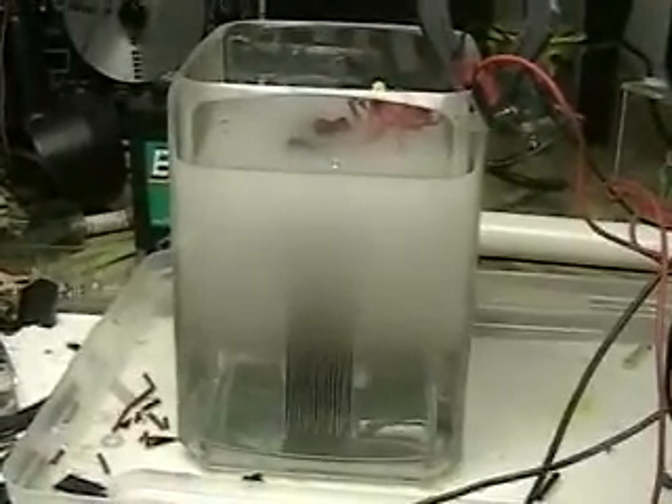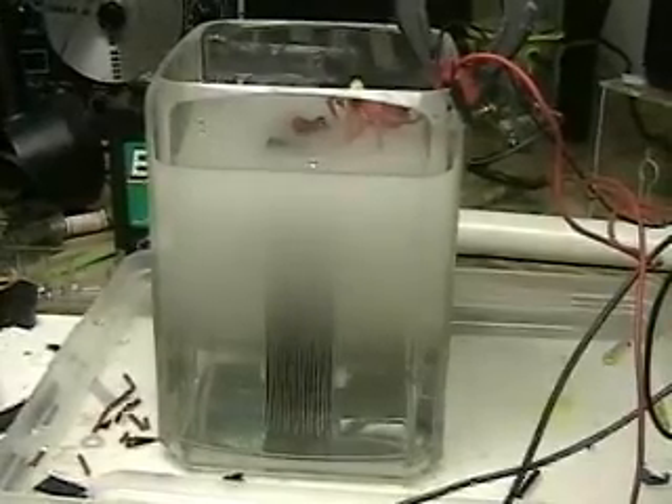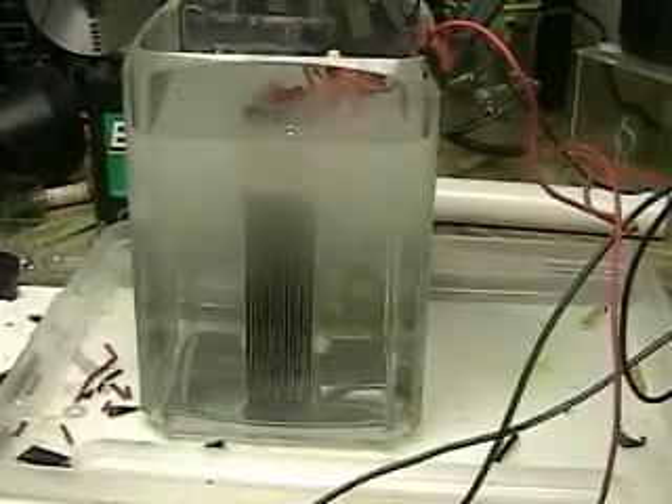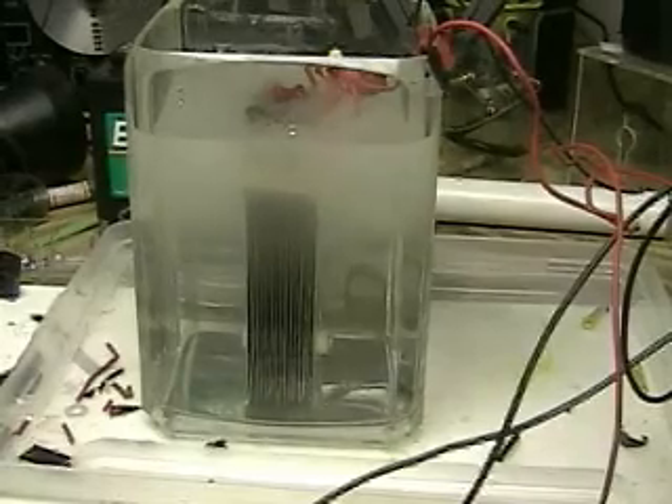This will be due strictly to the amount of plates in the unit. One of the problems I had with the unit as it was installed before was the water sensors. The new unit will have two water sensors: a high mark where the water starts, and a low mark for when it needs to be refilled. The sensors will have indicator lights in the cab — the first sensor will signal that we're below the first level, and the second sensor will signal that it needs to be refilled. Once this unit is completed, we'll install automatic water fills using the same sensors.